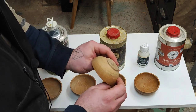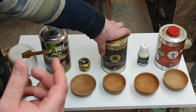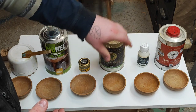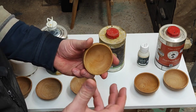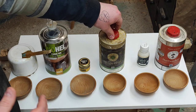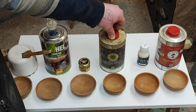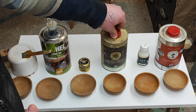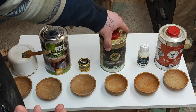and it's just smooth as silk still. So conclusion, if there is any, for the stuff that's going to be used frequently, that's why I'm using the linseed oil. As you saw, it's really easy to apply. It's really simple. That's what I like about this oil. It's quite simple, easy to use, and there's no fussing around with it, and it does its job pretty good. I would say it's comparable to Mahoney's walnut oil. It really does penetrate the wood, and it dries from the inside out, and it really does the job great.